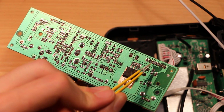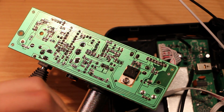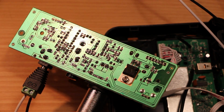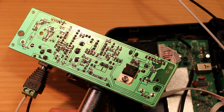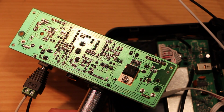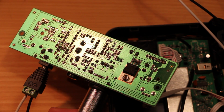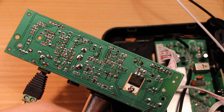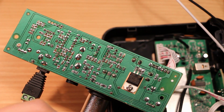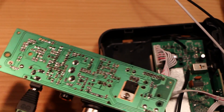This next signal, 3rd from the left, actually just runs right over into the volume control, back to the front of the case again. This is an interesting sort of design that doesn't make a ton of sense all put together, but the individual pieces probably make a lot of sense in the context of whatever modularity they were planning for this product line. So this audio signal here should be relatively clean. It seems like whatever noise we're tracking down happens after that point in the circuit.